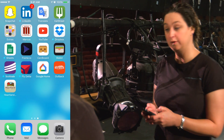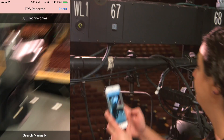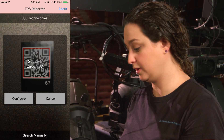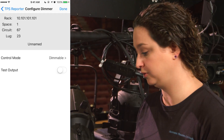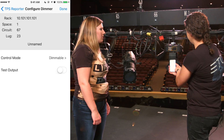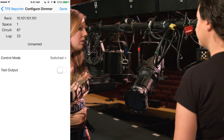You just make sure you're on the same wireless network as the racks here, open up the app, aim it at the QR code, and your phone talks wirelessly to the dimmer racks. So I just click on configure here, and I'll be able to see and change the mode for the through-power module. This one's in dimmed mode, which makes sense because we had a tungsten fixture here hanging for the last show. So I'll just tap control mode and pick switched, and now it's safe to plug the fixture in.